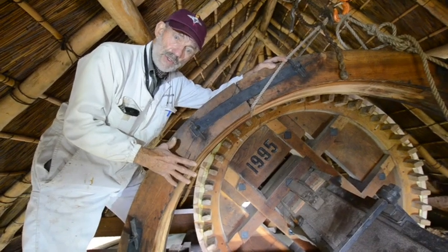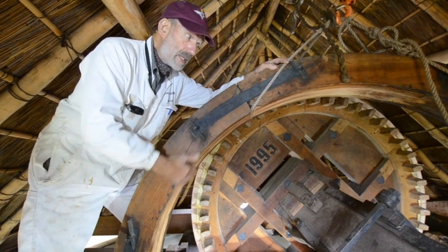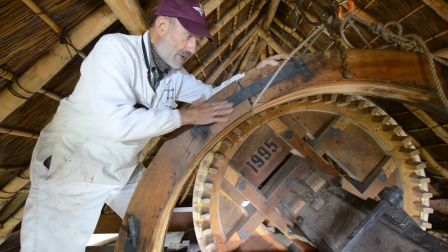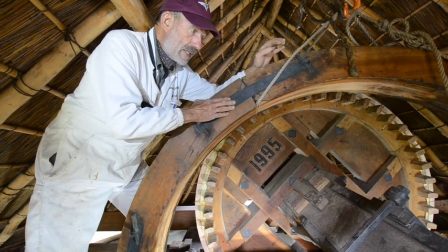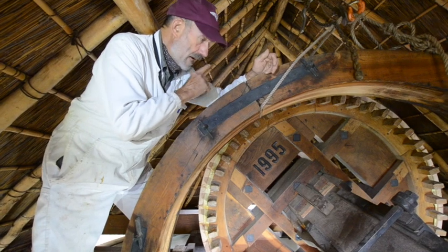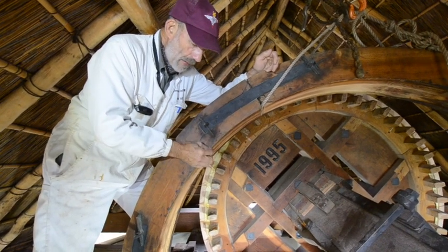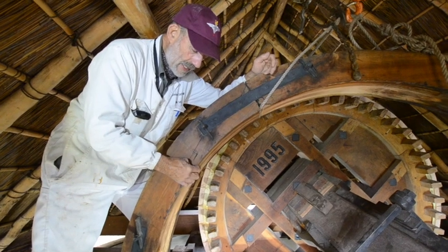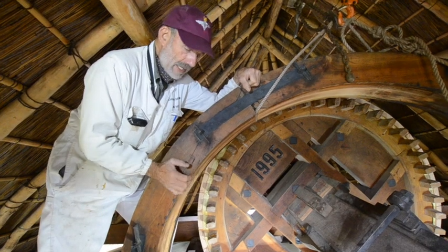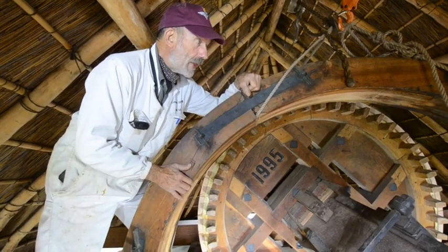Our next job is to turn over the brake assembly. This is the big brake block assembly. It's very rigid as one can see here, so there's no flexibility — it really has to be the same radius as the wheel, perhaps with a slight clearance, so that when the brake assembly is applied it deflects a little bit and then clamps the brake wheel.